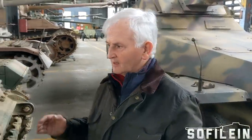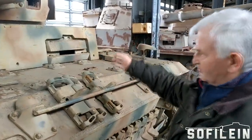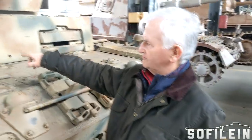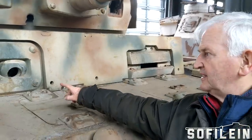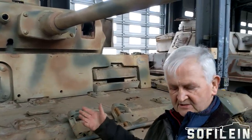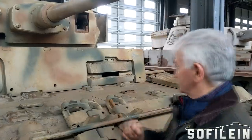It has then been upgraded with an extra armour plate, bringing it up to 50mm basis. The extra armour plate is on the hull. The machine gun ball mount here is interesting — it has a very wide circle in it because that ball mount will take an MG 34, but the normal infantry MG 34. So what they did: you could slide a normal unarmoured-barrel MG into that, and you had a kind of clamp that went around and filled the hole.